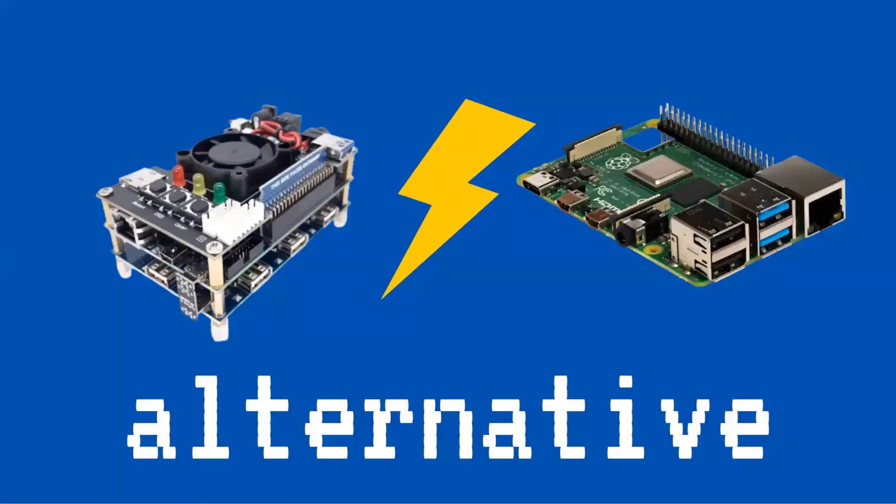Now I'm going to talk about some alternatives to MiSTer FPGA. The Raspberry Pi is more affordable than the DE10 nano MiSTer FPGA. A Raspberry Pi running RetroPie is capable of emulating everything from the NES all the way up to the PSP and Dreamcast. Unlike the MiSTer, the Raspberry Pi does this through software emulation, while MiSTer FPGA uses hardware emulation. The main reason to choose MiSTer over the Raspberry Pi is accuracy — MiSTer plays your games how they were intended, with fantastic built-in scaling options and internal filters with no performance impact. However, MiSTer FPGA is harder to set up, while the Raspberry Pi is easier but less accurate.